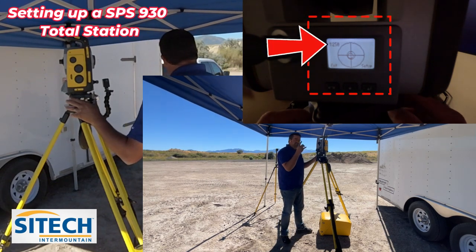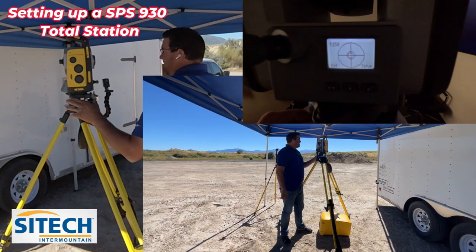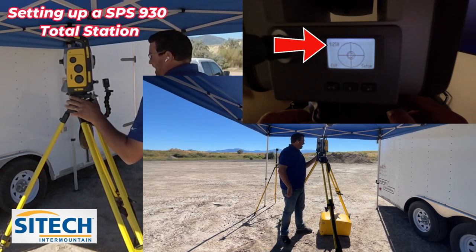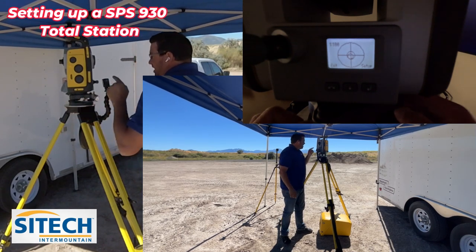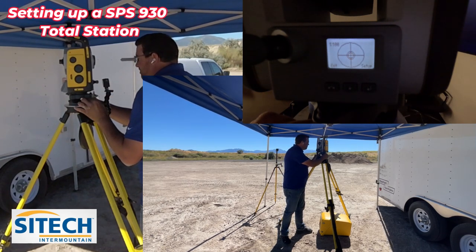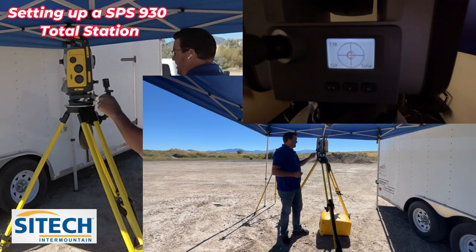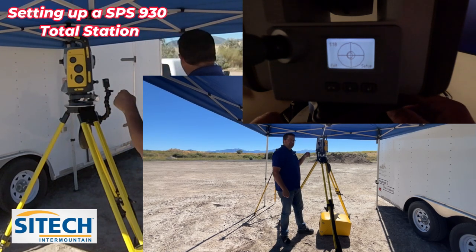At this point, there are four different settings and each one gets tighter and tighter on the bubble itself. In the top left corner you can see where it says the ratio is one to 250. Go ahead and level up to that and then hit the next button — this arrow down — and it'll go to a one to 100 ratio. Each time you can see the bubble might be out just a little bit; just go ahead and level it up. The closer we get on the ratios, the more sensitive these screws on the side become. Once I'm level there, I'll hit it one more time and now we're at a one to ten ratio.